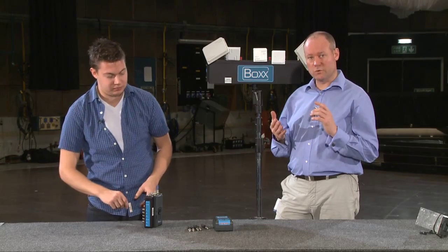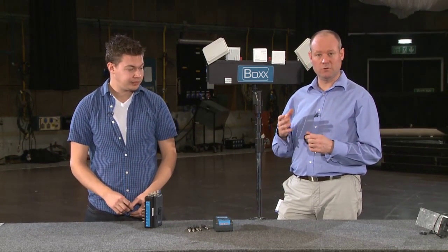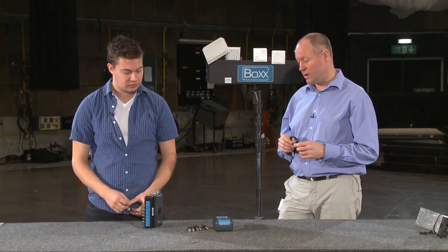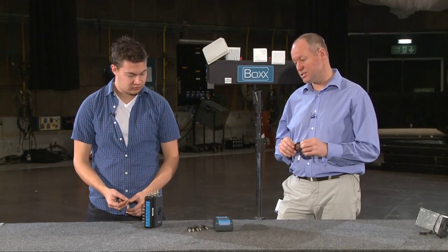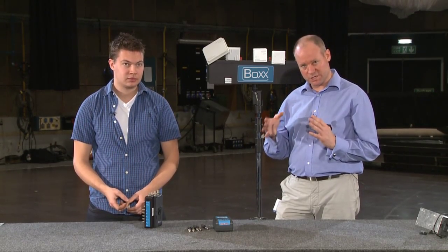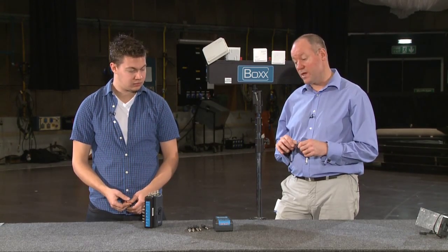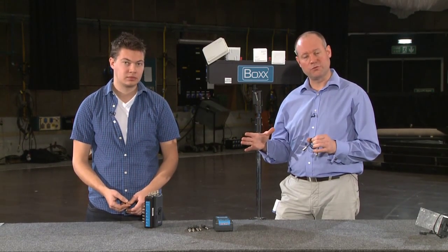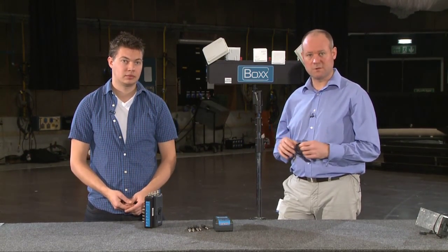That's right, and we also support all formats up to 1080p30, including 23.98. So it does all the flavours of SD and HD. We don't support 3G, 1080 50 or 60. There are ways of using the Meridian to do 3D, using 2 transmitters or muxing before, but if you need more information on that, give us a call and we'll explain that in more detail.